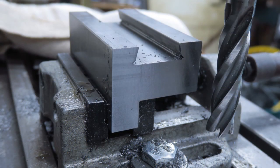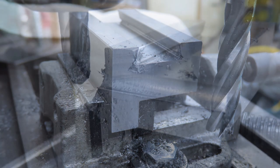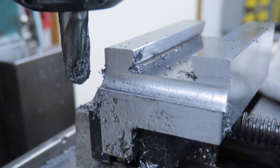I was suspicious about this cut. Even if the end mill is quite tough, it flexes. I was awaiting chatter and poor surface quality, but this one surprised me in a positive way. This is the side that points away from the workpiece. I used the round-nosed end mill to shorten the dovetail so that the blade fills it completely, to keep the chips from scattering in there.